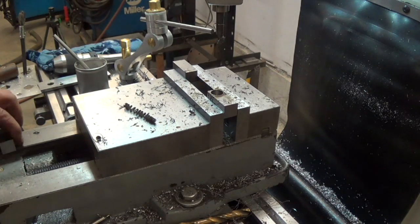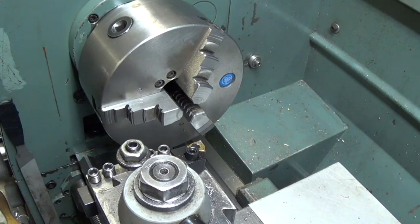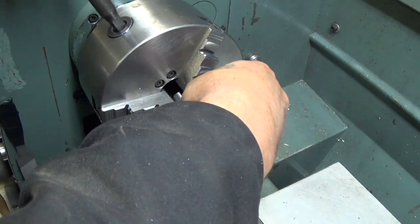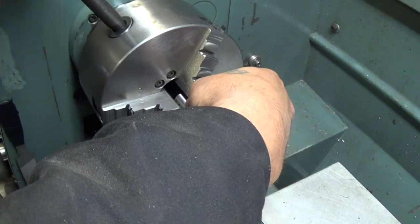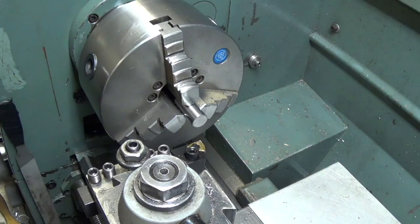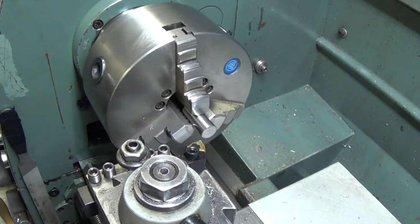Okay, so what I'll do is blast the bore in the other three and then go stick them into the press and get them assembled. We've got our blocks ready — we're going to take our pins and stick them in the three-jaw chuck. We're going to face them and put a little bevel on one end. The back side will be on the inside, so we won't worry too much about that since it's never going to be seen. Then we'll head on over to the press.